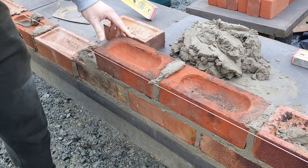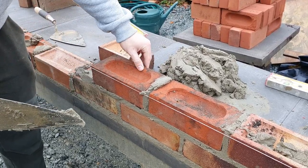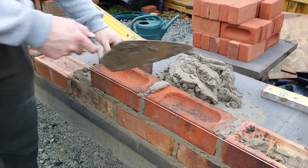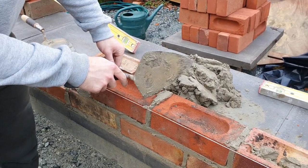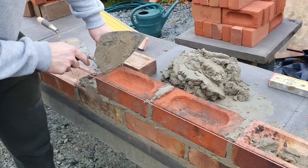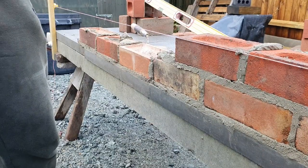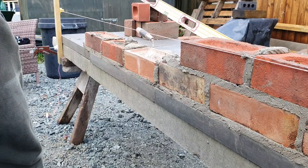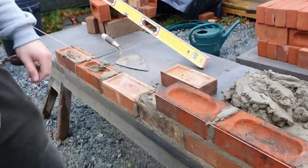So what you would do as well when you land your brick, that's better, isn't it? Yeah. You try not to touch the line with your thumb, because if you were with a brick the other end, he'd punch you. And rightly so. That's part of the learning. Remember when you tap the brick, look, it's no good, but you've got to hold it. Okay. Go again then.